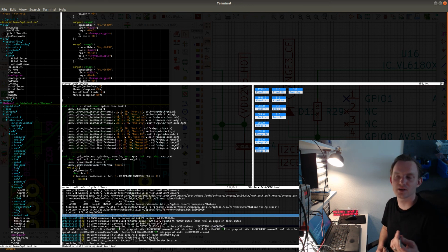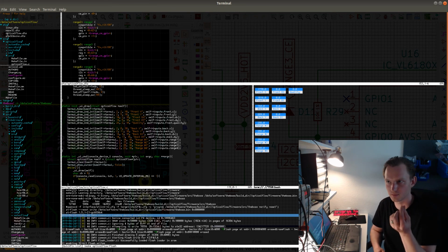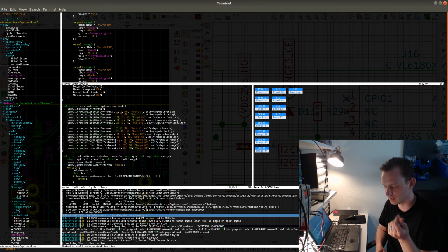I wonder if there is some dust or flux or something else that maybe got into the hole of the sensor that is causing some sensors to malfunction completely, even though communication is okay, and some of them give wrong readings. So it could be anything. The sensor, the hole where the light sensing element is, it's completely open, so anything can get in there. Which is a bit unfortunate. Like, even the flux will easily get in there.